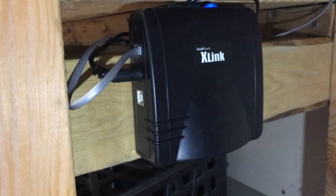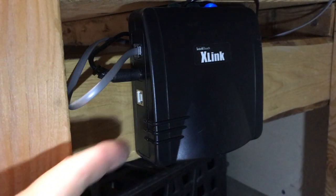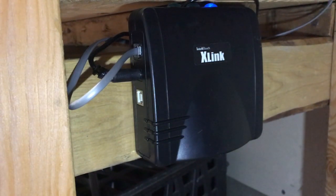There are several different types of X-Link adapters. The one we're looking at has only one RJ11, and that is the line to the phone or the key system. They make a module that's identical in appearance and size with one exception: there's a second phone jack. So if you do have an actual landline, you can run the landline into this device, and then from the device back to the telephones within your home or business, and you can use the cell phone or the landline to make or receive calls.